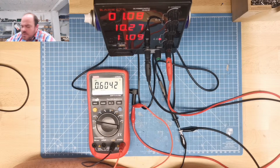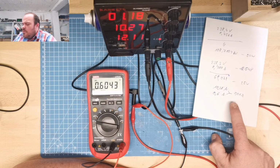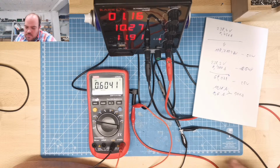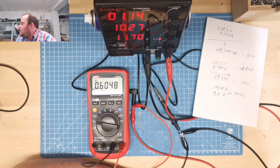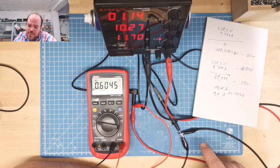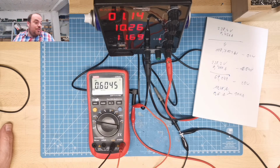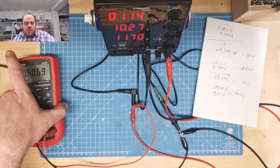About 60 milliohm is this cable. Oh, it's getting a little bit warm, not too bad. The other was 0.058, but the Unity cable, the same length, was only 30 milliohm. If I find the Unity cable, to be honest, I forgot which one it was. I think maybe it is this one. We should see a difference.